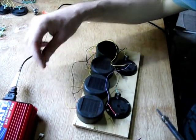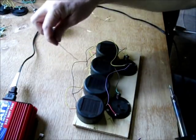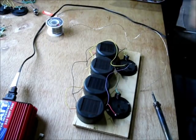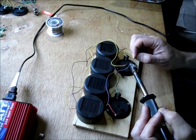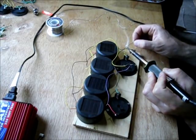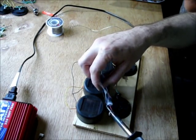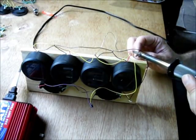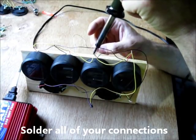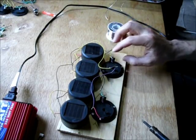Now I've got all my wires — just plus to plus to plus to plus. Everything's parallel, all parallel together. The current from all the solar cells will be added together and put into the batteries. The minus is all parallel as well. Everything's parallel. This is off-grid power — everything here is off the grid, and the energy powering this soldering iron is from the sun. All parallel together; making sure we've got all the solder joints. Shut off the soldering iron and we'll take it outside.